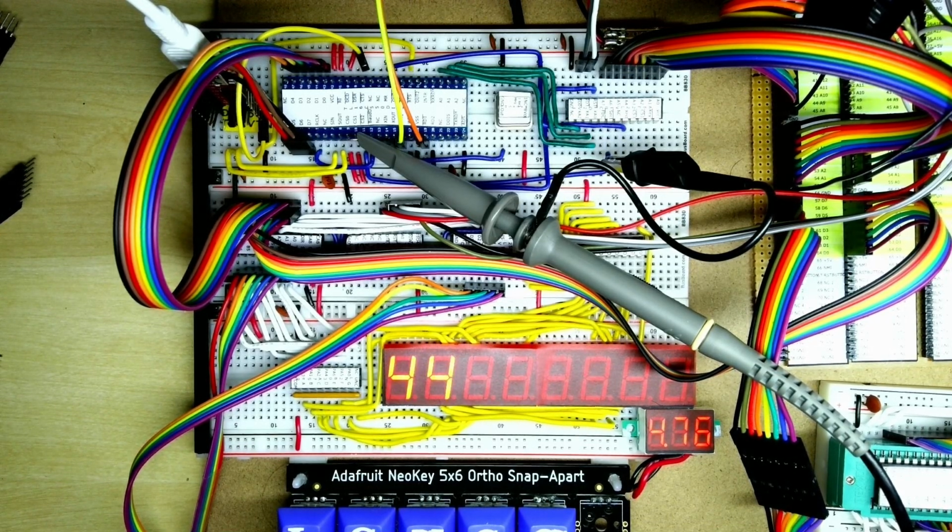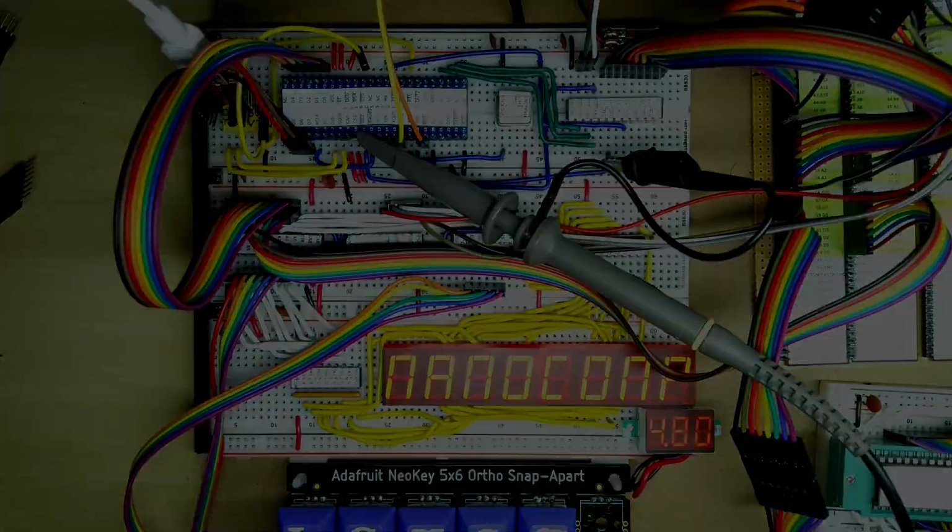So that indicates that the download is working. The saving appears to be working. I'm going to do some more testing on it, but it looks like those side of things are working okay. So I've got the serial port working, though the reset issue did take quite a while to resolve, and it's only after I put the oscilloscope on some of the lines that I saw these spikes and things. So it's always worthwhile having something like an oscilloscope. You don't need to use it all the time, but there are those occasions where everything else has failed that the oscilloscope actually picked up a particular problem.